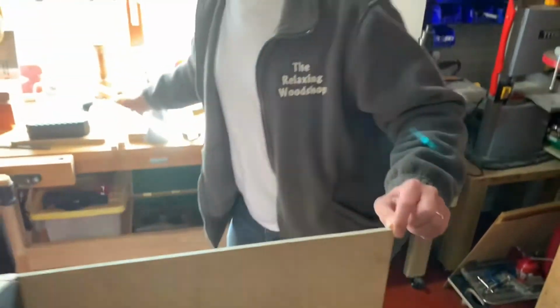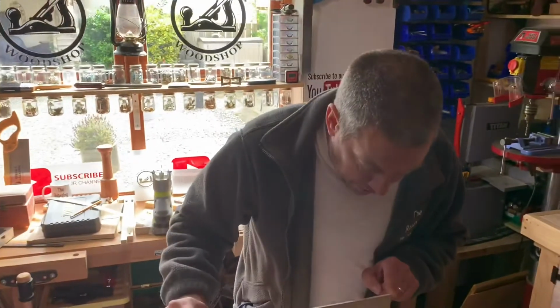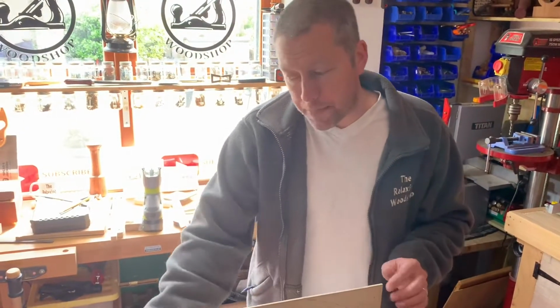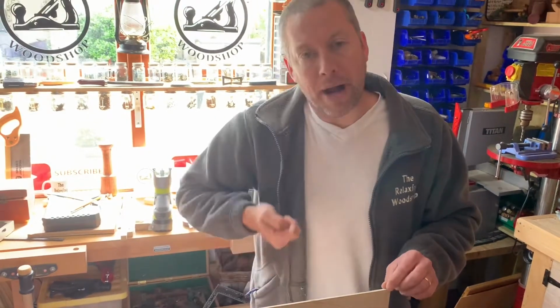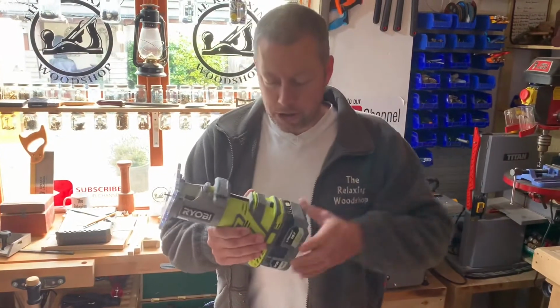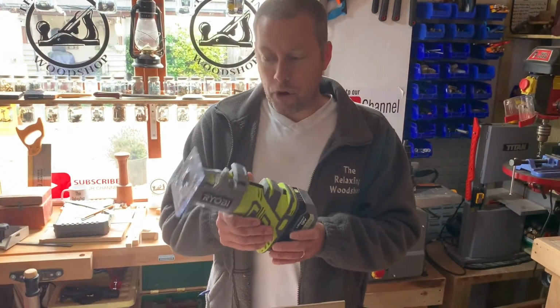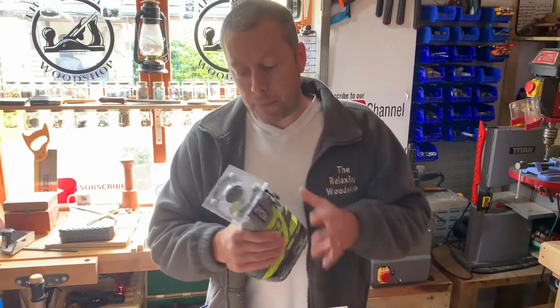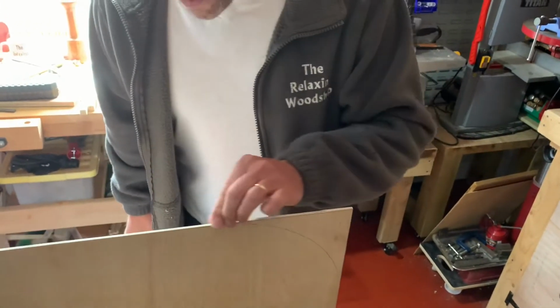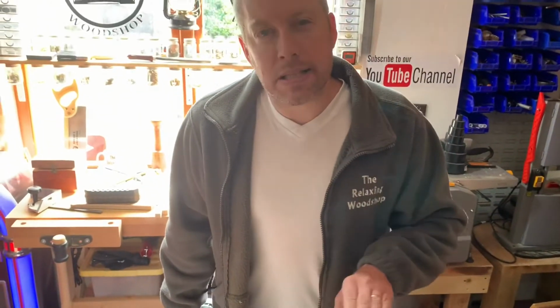Now, on this part here, after looking at it, it is very flimsy at this back end because there's no support. If I put a jigsaw on that, it's going to vibrate and probably come off at this end. If I put a handsaw, there's probably going to be the same problem and I'll not get the same curve. So what we've decided to do is use the Ryobi, non-sponsored, cordless router with the wee router bit at the top, and run the line probably just above it, no more. We want to sand that back so it's nice and smooth, because with this being 5mm, there is a wee bit of give that you can sand it down, whereas the aviation plywood, there's no sanding involved, because any sanding, you just go through it.